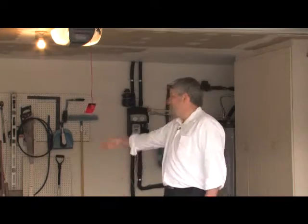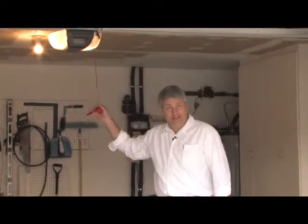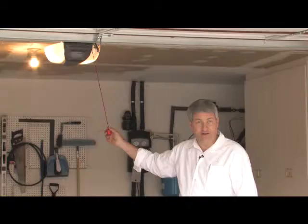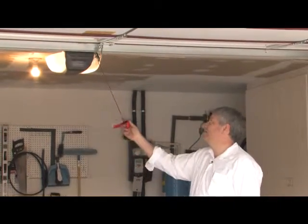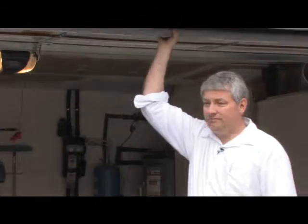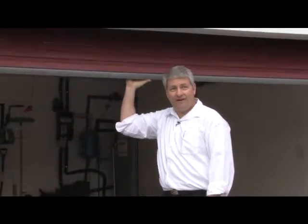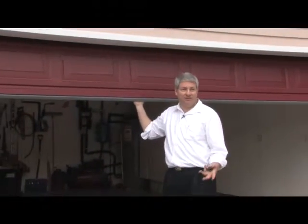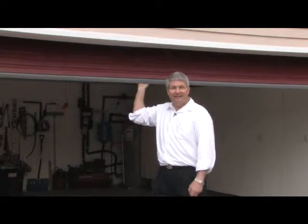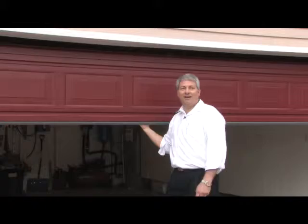The control descent device is a falling door safety feature. For example, if someone were to release this garage door during a power outage or some kind of failure and close the door manually — if it goes faster than 5 inches per second, it stops the door. Then you push the door up, it will reset and lock it up again.